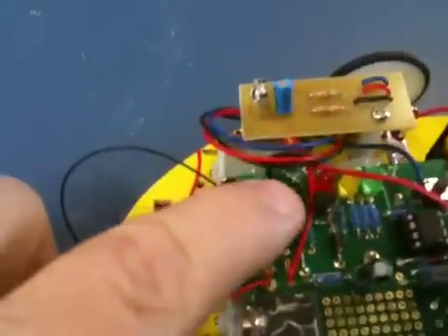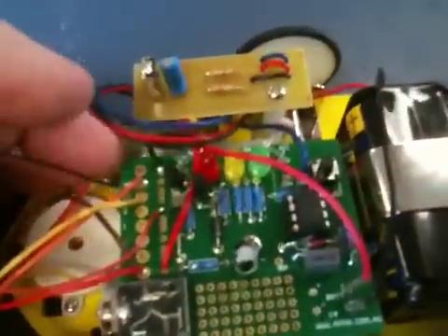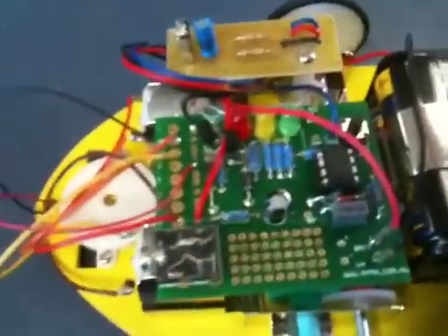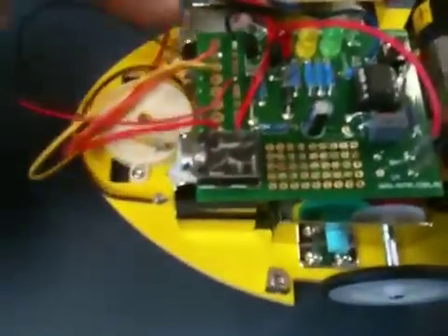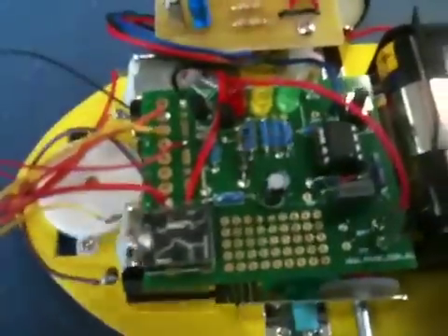It's quite simple. The reason it can do this on this PICaxe board is it has two Darlington transistors, which can drive a motor directly. However, it doesn't have reverse — it only has forward speed, so it's either off and on, and it can control either motor. Stop — and that's how we get the skid steering arrangement.